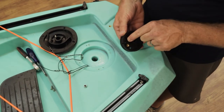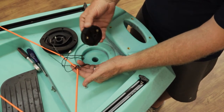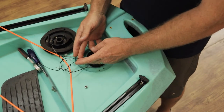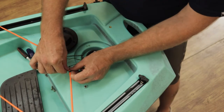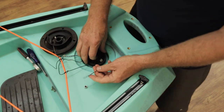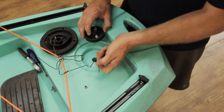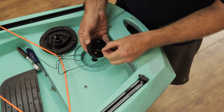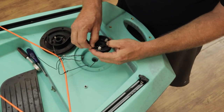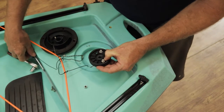On the spindle there's a small hole at the bottom over here — this is where the left-hand side cable is going to go through. There are four sets of cables here. The inserts are for the handheld rudder; the outserts are for the foot pedal rudder. We're going to line this up, put the cabling through here, and then immediately tighten up at least a little bit so you cannot lose the line inside.